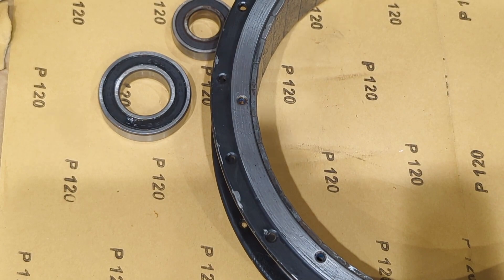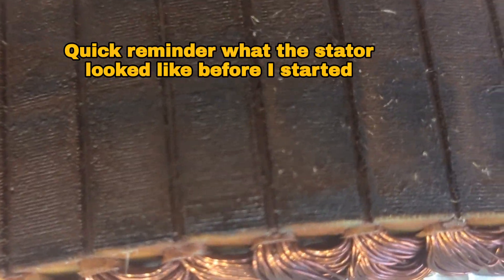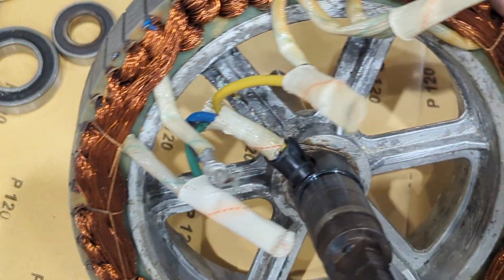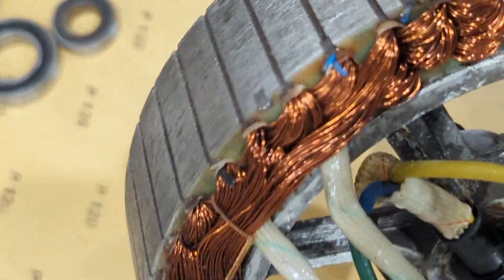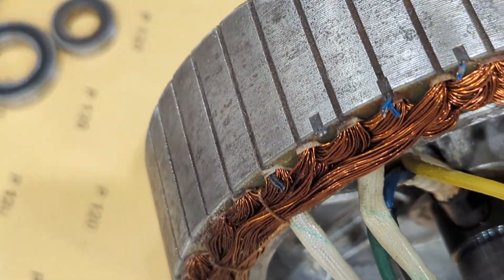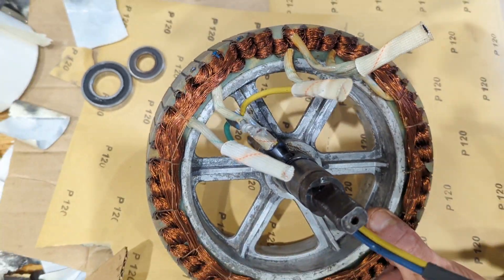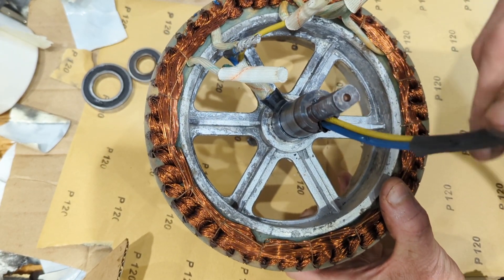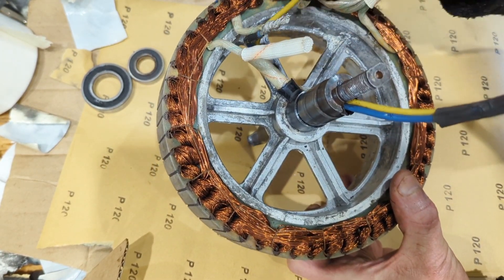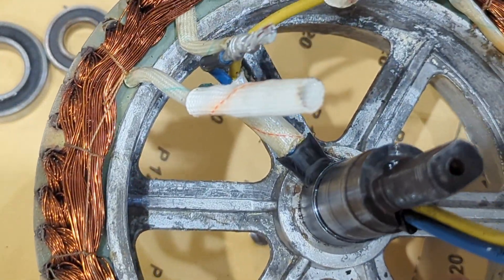And that's probably about four hours on that. That's the rotor. So this is the stator assembly — not as cruddy as the other bit. Now what I decided to do with the stator was remove the hall sensors. You can see there are remnants on that side and that side. I don't know why it's had two, but it has two. So the only wires we've got in here now are the three phase wires essentially, and they've been unclipped to give me access to try and clean up all the bits inside.